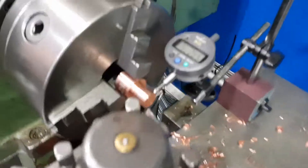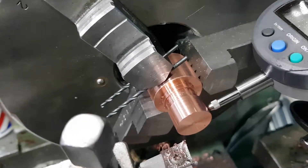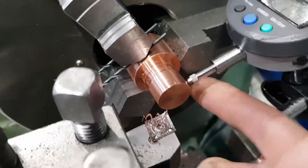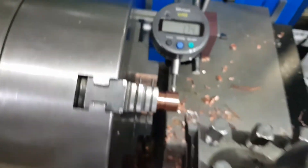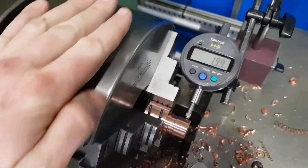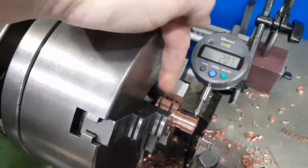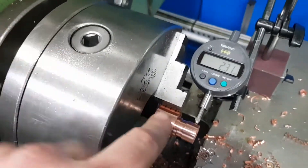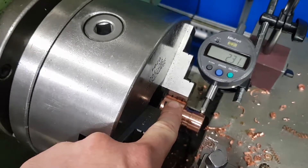What I've done is set this up in the lathe and jammed two drill bits on one side of the chuck in order to offset the major axis of this piece by far enough that it should be swinging 2.6 millimeters off. I've got an indicator set up, and this took a little while to figure out what size drill bits to use — it's not quite as obvious as it would seem because there's some V-geometry down in here that captures different size drill bits in different positions.